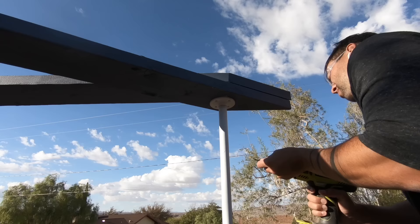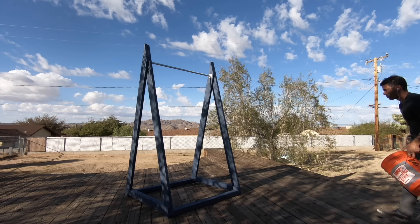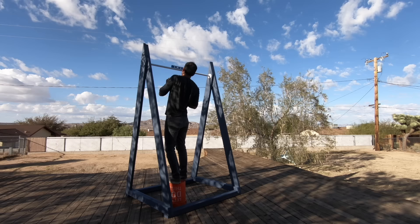For the other end of the pipe I just used one screw for now — just to give it enough support to lift and tilt the whole thing up so I can use a level to check and make sure that the bar is nice and straight. This structure is plenty strong to hold my 170 pounds, but if you wanted to you could add additional pieces of 2x4 or even some heavy duty L-brackets to increase the strength.